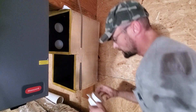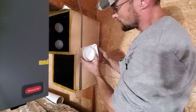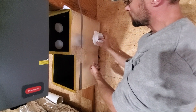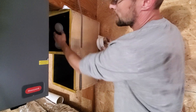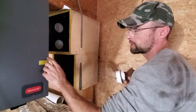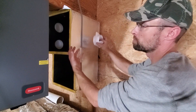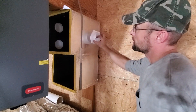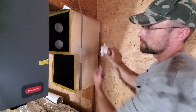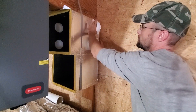Got the bottom plenum box installed. These are the flaps that I had to fix the tension on because they were just too tight — they would stay closed. I've got to put those in this way so that when the air is on, they'll suck open. If a bathroom vent is turned on, this is a 200 CFM ERV and the bathroom vents are 100 CFM each, so if two of them are on at the same time, we'd be blowing more air into the box than is being sucked out. The flaps should slap shut to prevent air from being blown into other rooms or getting sucked out the ERV. I've got three on that side and two installed on the other.